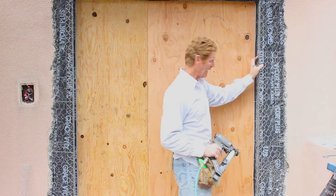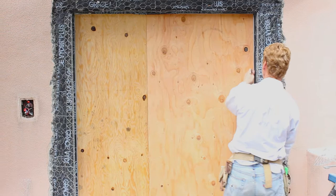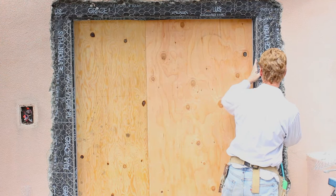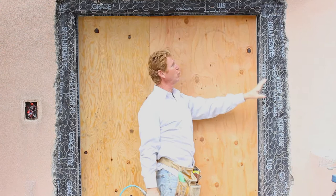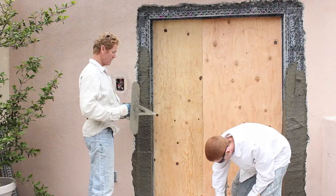Last thing on the lot: these corners have got to go on so that they're true and plumb. They've got to be true this way — these are my guides for when I put my stucco on. On the inside here we have metal which is one inch thick; they want the stucco to come out seven-eighths. So it's got to come out seven-eighths, and this stucco here is actually about an inch and a quarter — sometimes we get fluctuations. I'm using my gun, looking at this side, bringing it out, then looking at this side, bringing it out. True and plumb — it always helps to use one solid piece; don't put up two or three pieces. We caulk all our seams, caulk there, caulk here. We're ready to go for cement real soon.